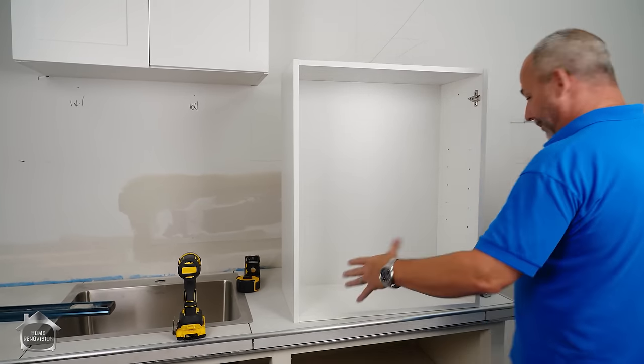And try to go in between, just behind the hole, above it, above your eye level, so you can't ever see the screw. So if it's below your eye level, you go underneath the shelf, and if it's above your eye level, you go over the shelf. All right, and you won't see the screws. Now, I'm gonna screw this one right here, a couple inches back. Done, that's it, right? Just till flush.